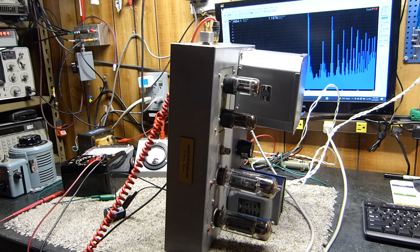This is so easy to see. One of the things that I have always said is I ground all of my power supply components — like the electrolytic capacitors and the center tap from the power transformer — everything that has to do with the high voltage power supply, grounded at one point over next to the transformer, maybe even at the AC input, as far away as we can get from the signal input.